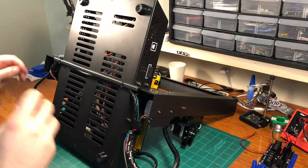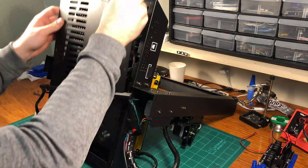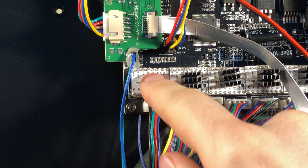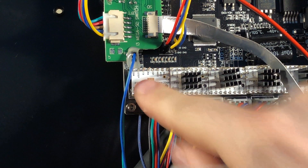To replace the stock stepper motor drivers, go ahead and remove the bottom plate on the printer with an M3 hex key. Next, you're going to want to remove the two screws that are holding the cooling fan mounting bracket in place. With that out of the way, you can go ahead and start removing the existing stepper motor drivers. They might have a little bit of hot glue holding them in place, but you should be able to scrape that away without a problem. You should then be able to start installing the new drivers, which for me was by having the blue pins at the top.